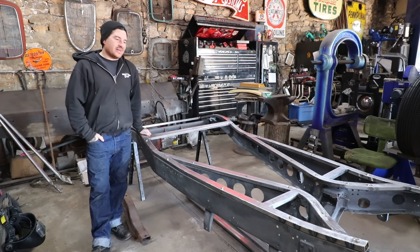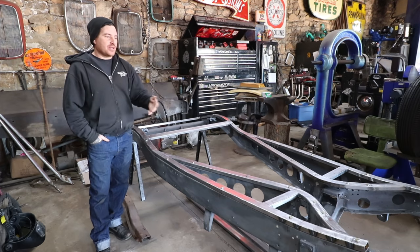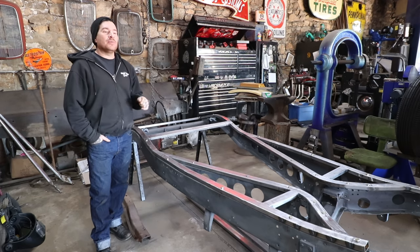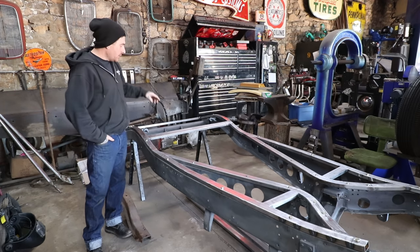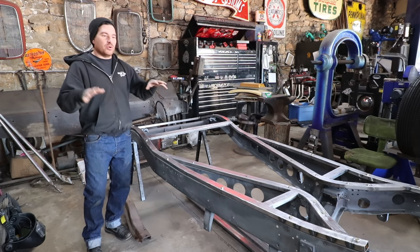After a bunch of work, I probably had like 2, 3, 4 hours into just sanding both sides of this. We had to sand all the welds on the bottom side to make sure that it bolted flat. I had done all the welding on the bottom. Now, the only downside with doing this with the pie cuts or the relief cuts is that when we're welding everything together on the frame and fixtured, nothing really moves around because it's all bolted down fast.